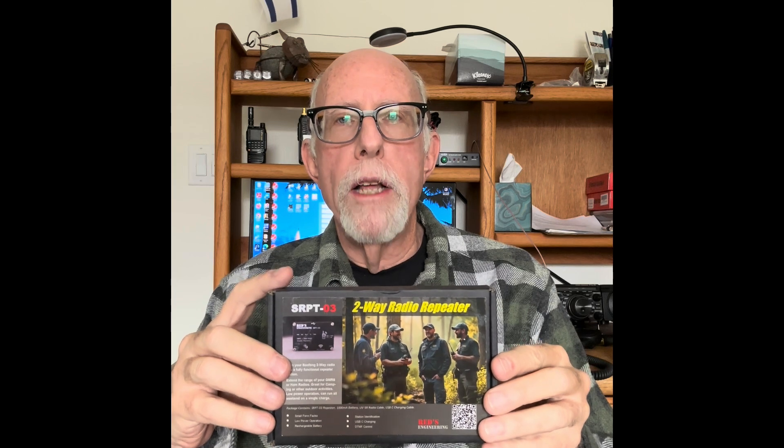For the $10 more, it's worth getting the extra recording time. This is a simplex repeater, also known as a parrot repeater. It uses one radio. You call into that radio using another radio. It will then receive your message and transmit it to the repeater box. The box records the voice message, then stops reception and starts playing back the recorded voice message, transmitting it back to the originating radio.